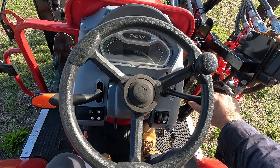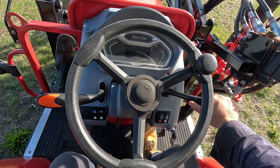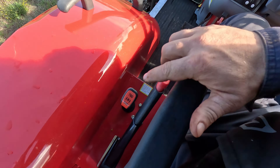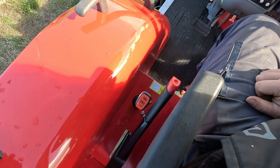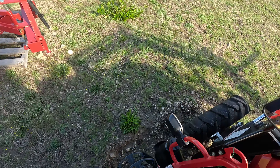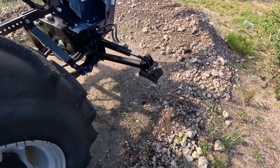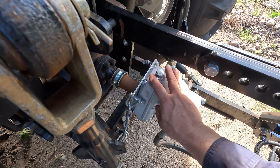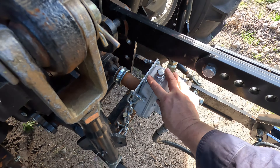We want a few revs — around about 1500 — and then PTO on the slower speed, which everything that comes with UHI works on. Then we can get our pumps working, and it's all chained off so it doesn't spin on us.